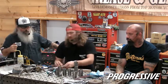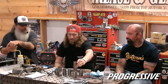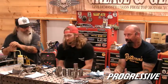And with stainless, with mild steel, like we were talking about, 1 amp per thousandth. Aluminum is anywhere from 20 to 30% more, would you say? I just kind of wing it. That's what I do too. And you can overcomplicate anything. You do anything for so long, you just kind of get a feel for what's what and where your amperage is set.